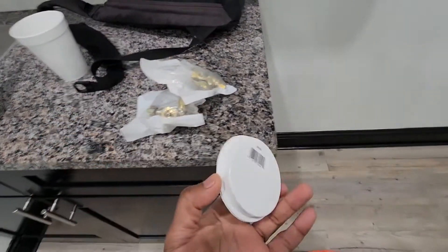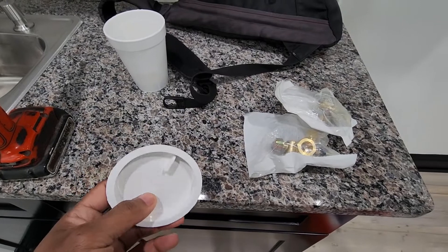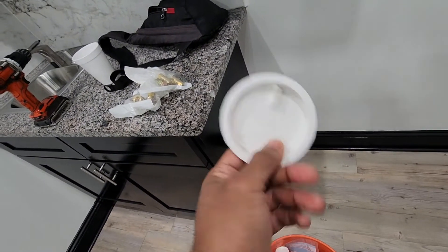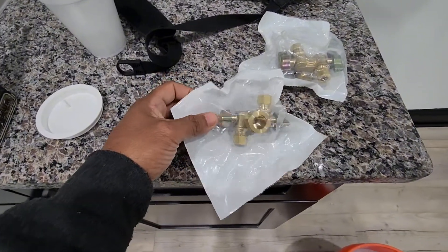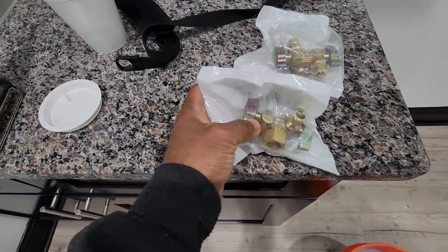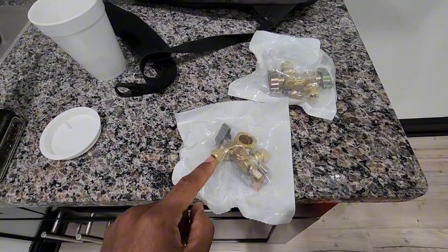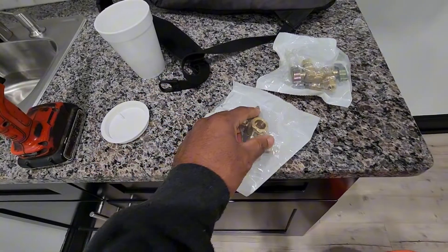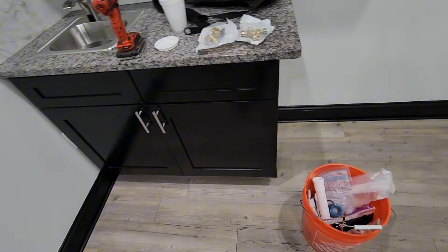This cap is going to go in the side of a room that has a hole where a wash bowl used to be. Whenever we take a wash bowl out and the tenant doesn't need one, it leaves a hole — so we just paint this cap black and cap that hole. This is what the lock-off looks like. We replaced the one that's under there, and it has two outlets with individual lock-offs. One goes to the sink, the other goes to the wash bowl, and the main connects in the wall.